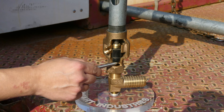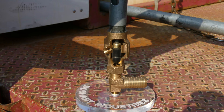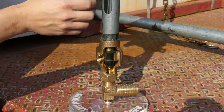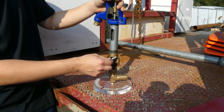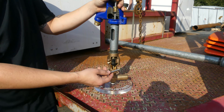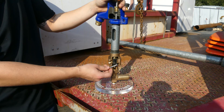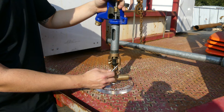So this plug here stops the water from going up past this point. Once you open this frost-free, as we open it here, you can see that it opens this port, which allows the water to travel up this channel and up through the valve. When this is open, the water is able to pass through. Interestingly, this is not a very big area, so you're never going to get a crazy amount of volume through these unless you've got crazy pressure on your system — probably not recommended for running a lot of sprinklers, maybe just a couple.